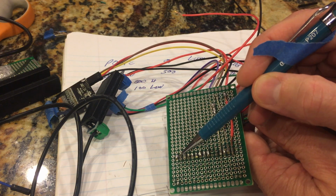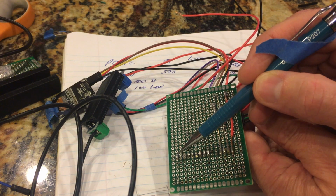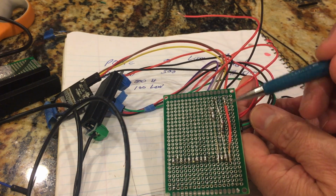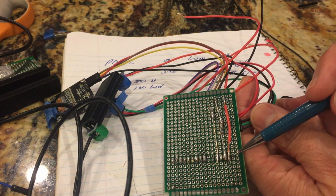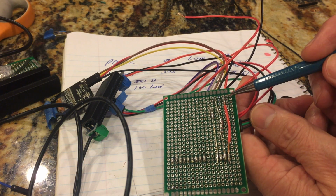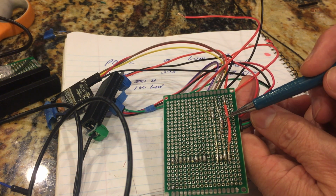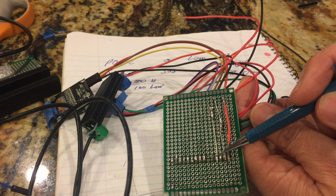But you take some solder and you solder here and you solder here, and then you take more solder and you work it between here. It's kind of a tedious process, but you can do it. And then I applied the same technique for the other header pins, which you'll see a little bit later in the video. And then I took a wire, this one was red, so that I made it very clear that's the V in. And then this is ground, and you can see it's diving over and it comes into the ground. And then this would be the 5-volt pin.